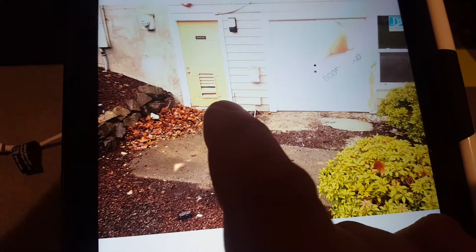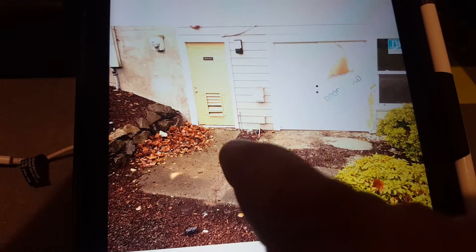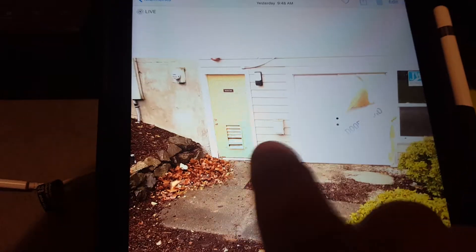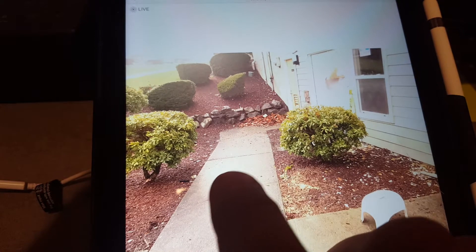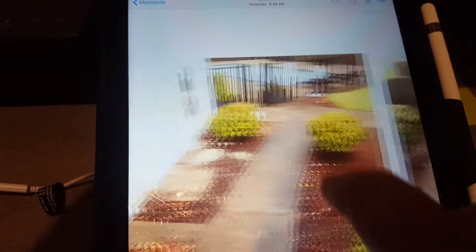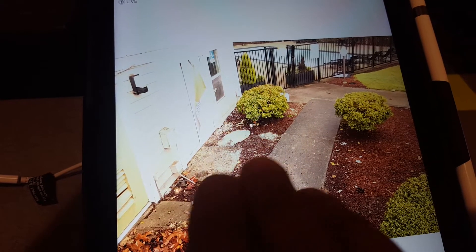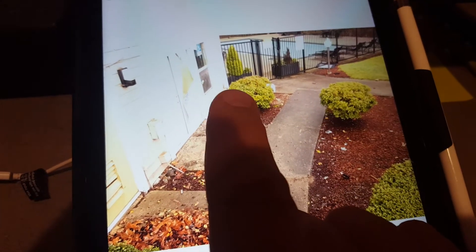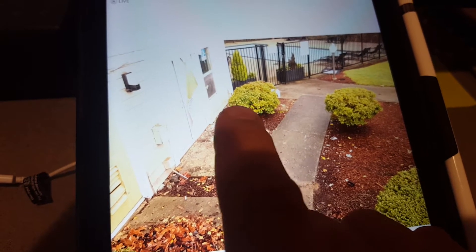Here's looking into it against the building. All of this is concrete, so this sidewalk is going to come out so that we can get proper flow from the building. From the building here going this direction — this picture right here — we want this to be the high end and we want the travel of water to flow this direction.